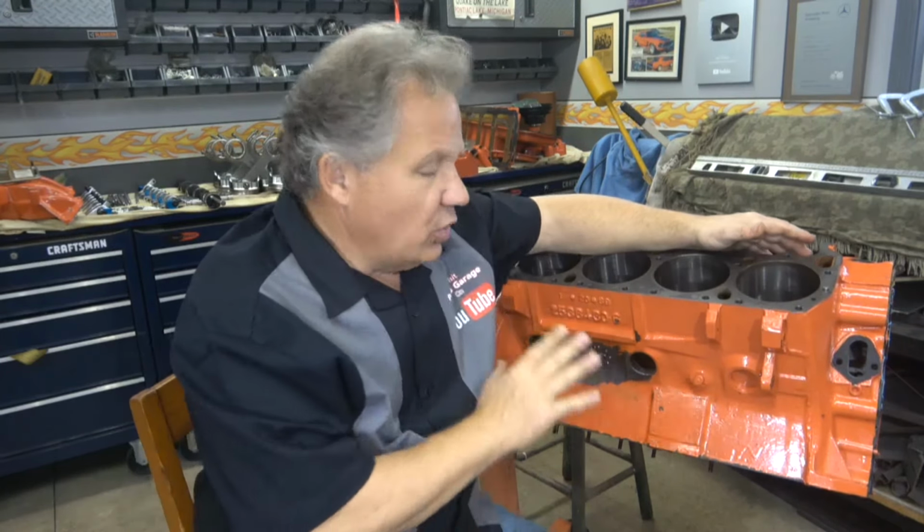So at the beginning of the video, we talked about the dyno testing. The first thing the owner asked was, did you notice during the dyno test, would it leak? The answer is no, because when you dyno test an engine, you don't put the coolant under pressure. There's no radiator, there's nothing. You're only running the engine for a short period of time, except for the break-in.